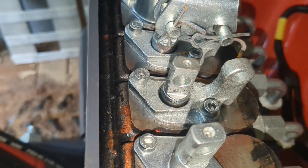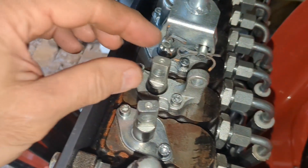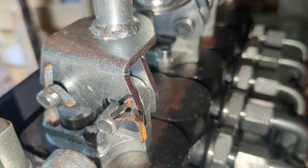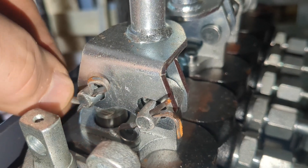I currently have an Allen wrench on it, and luckily we can just spin the rod on the top to help tighten it up. I can just hold the top here with a crescent wrench and try to put some pressure on the bottom, but I'm not sure how much torque I can get on that thing, and I'm not sure why it came loose in the first place. We got all those bottom bolts tightened up. The good news is it is not moving up and down anymore. So let's put the control stick tower back on and see how it works. I'm still not happy with all the play in the track controls — I don't know if we should put bolts in here instead to get rid of these janky looking pins.